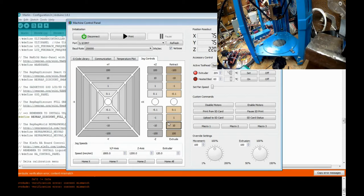Next step is to load an STL file into your favorite slicer, slice, and print. I'll probably retouch on these configs or on these controls using Pronterface in my next video, just to have a little bit of variation. Then I'll show you how to load an STL file and how to load it on the printer some way, shape, or form. Because I'm using RAMPS, I have an SD card reader. I can print any file. I don't have to rename it 101 Hero. I will get to that in the next video.